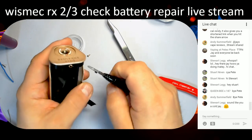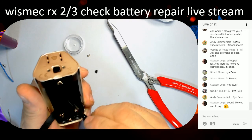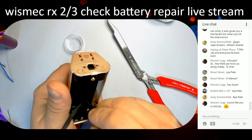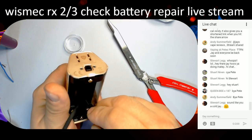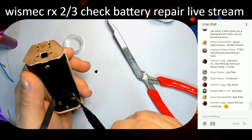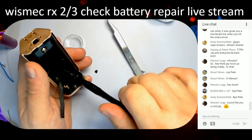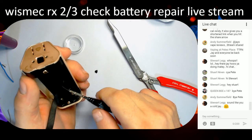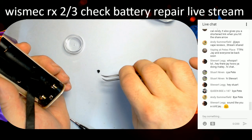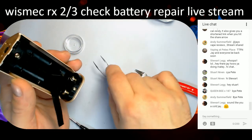So that's all the main screws in. Now comes the fun one, because this one might have to be done off camera because it's a right pain to get in the right spot. You have to bend the plate first to get it to sit right, and because it's gold, it's magnetic. Well, it's monkey metal then, isn't it? The last few I've done haven't been magnetic, so in you go. Make sure that's nice and nipped up, but don't over tighten it. That gives you your negative contact. So now we pop the little rubber bung back in. Somebody's already been in this anyway by the looks of it. Put the little rubber bung in and there we go.